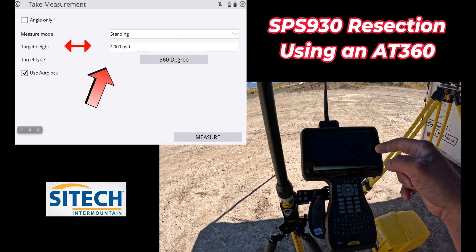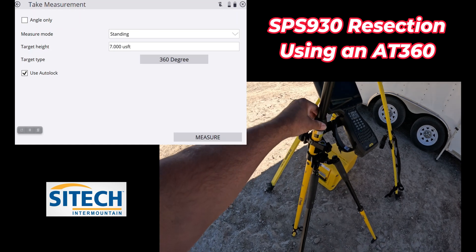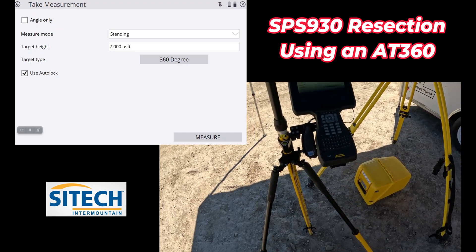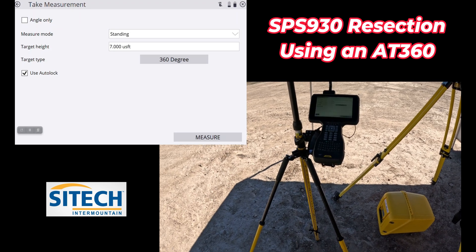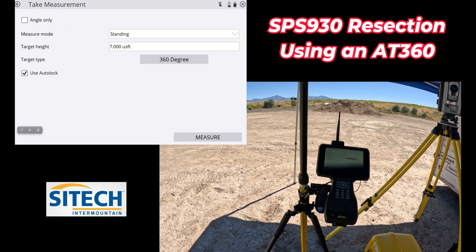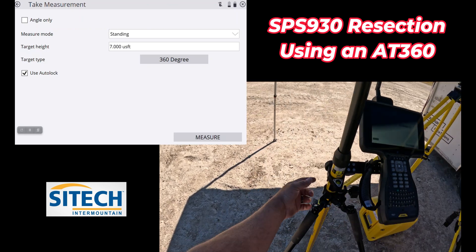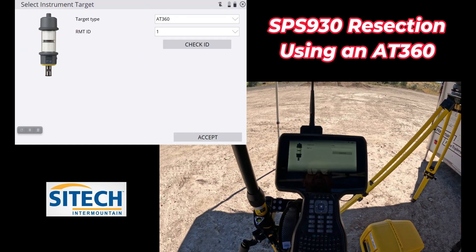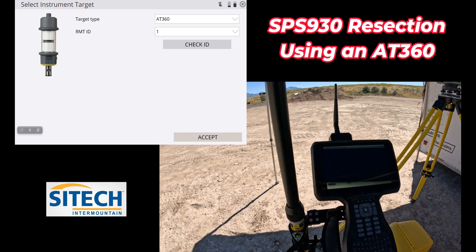This is going to allow me to check my height. Now with my two meter pole — some of you who do a lot of this will recognize I'm just using my GPS pole. I personally just like using one pole because then I don't have to carry two, and I can switch back and forth between GPS without worrying about it. Plus with the total station it's all line of sight, so at seven foot it's always above my head. So two meters, AT360 — I've got to change that right here. It's the bottom of the list. It will not let you do it passive; you have to have it turned on. The lights are on, pick channel one, go ahead and hit OK.